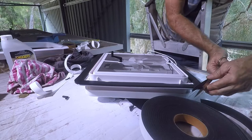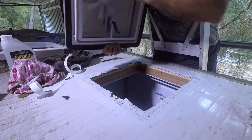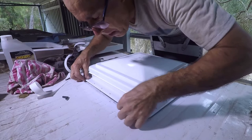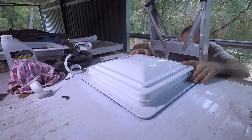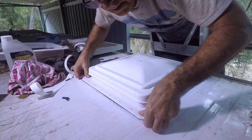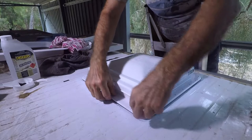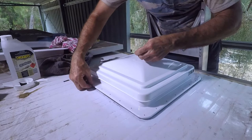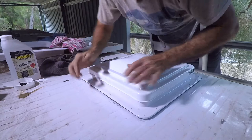There's the weather strip around the outside edge. I'll lay the unit in and wire it up in a minute. I know it's probably going to sit proud by that gap. I'll get inside and make sure it's squared in the hole. The screws that came out were only 20mm, but because we've got that extra thickness of the weather stripping, I'm going to have to use longer screws and run a bead of silastic because we did damage that tin slightly.